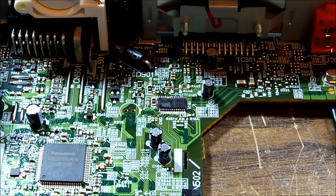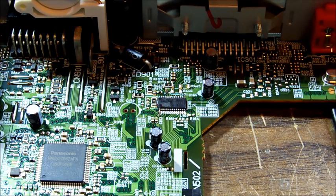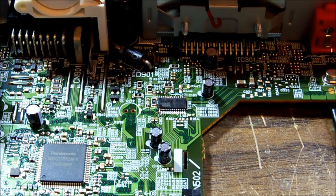But I could be wrong, but still, the fact that it's pumping a steady voltage out of all of the inputs, there's every chance that whatever's gone wrong in that chip has been a result of the person who owned this having wired it up backwards. It spiked the chip and upset it, which is possible, because I believe that's exactly what happened to the last unit we looked at, and this is the IC out of that unit. It's doing the same thing.